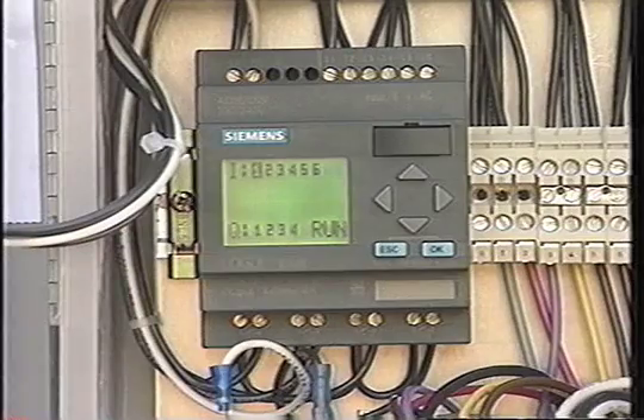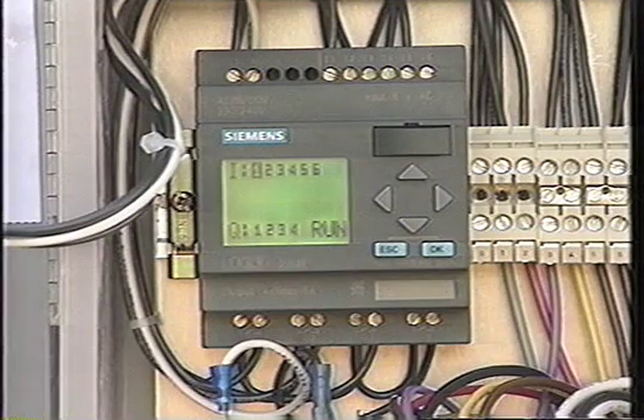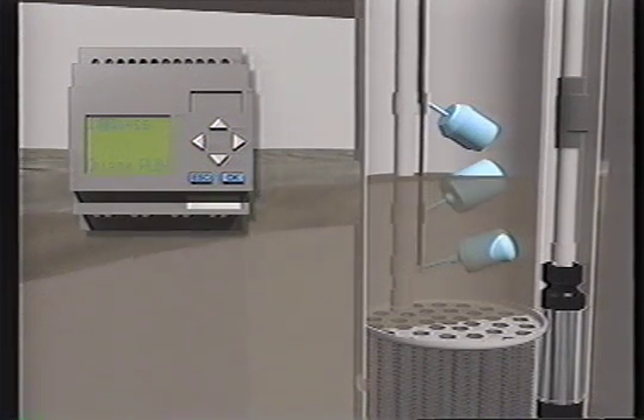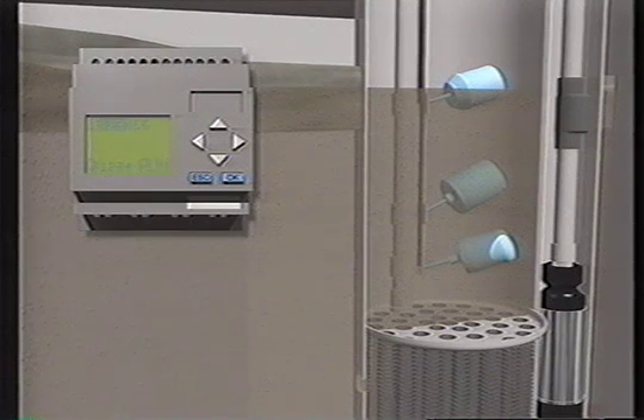After you receive your MVP, you can easily reset the panel's timing parameters in the field. The logic unit has an LCD screen on its face and its own programming keys. Here, you see the LCD screen when it's in run mode. Inputs are on the top line, outputs are on the bottom line. As a function is activated, it's highlighted. You'll always know just what the floats are doing without having to peer inside the tank. And an MVP even allows you to use a single float for all functions.